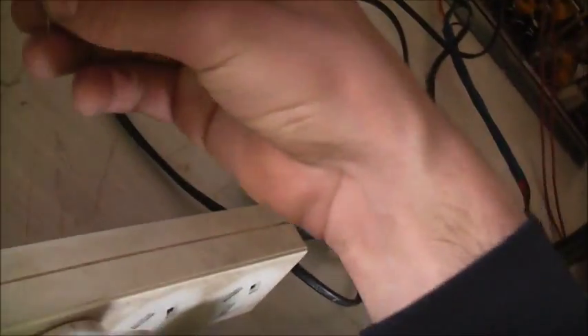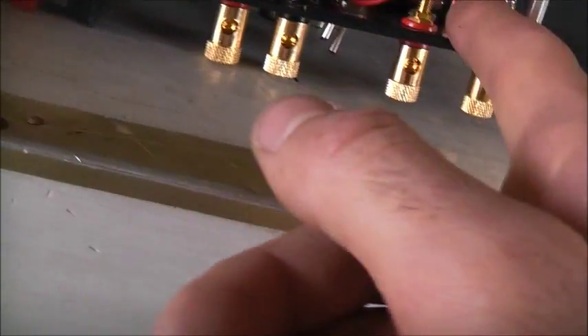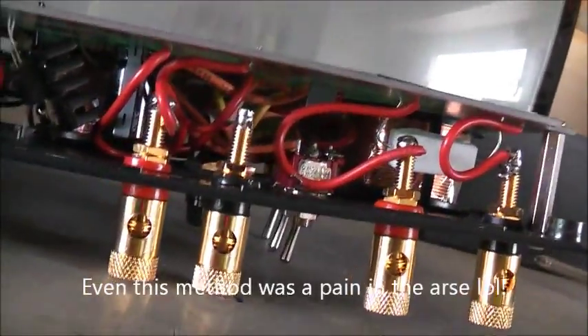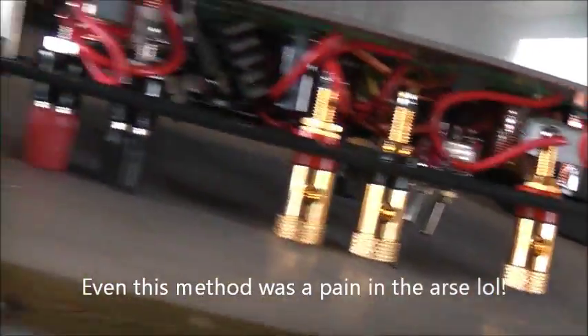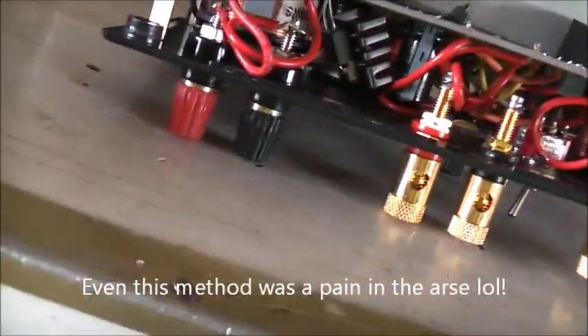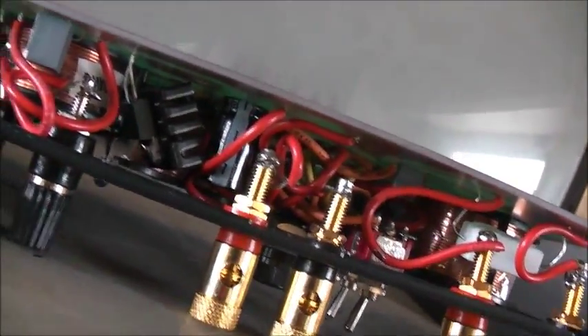There are little jumpers included — you're supposed to use component lead wire. It gives you a roll of that and you're supposed to bundle them up and poke them straight through and solder them on through the board. Well, that just didn't work out. I could not get that to work and the possibility of shorting was too high. Actual proper wiring like this is a good way to go — a lot safer and a lot easier.